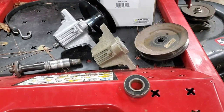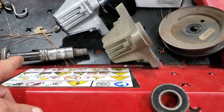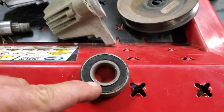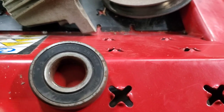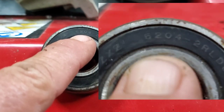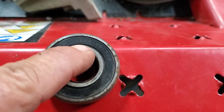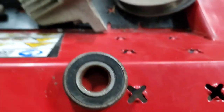Before I show you about taking those out, I'll also show you how to do these shafts. You can just put shafts in. Now, the bearings — I'm going to try to get a picture up close on screen. There's a little number right here: 6204 on this particular bearing. You can look that up, order your new bearings, and put them in here.